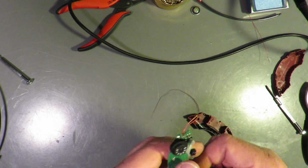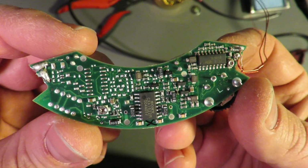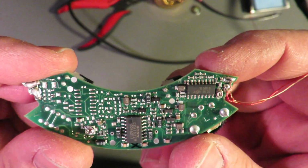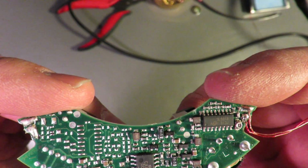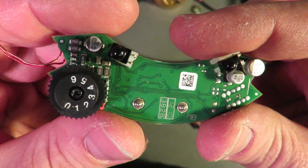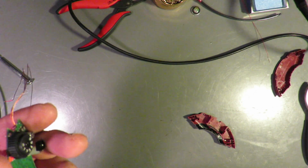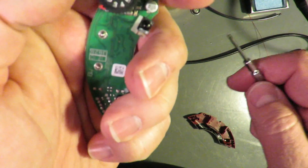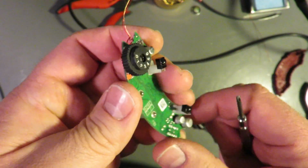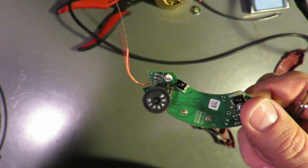why not make something? So it looks like, in case anyone is curious, the inside of these, this is the side that you will see when you open it up. The earpieces solder on to these liberally applied dabs of solder. A couple of chips in there. Don't know what they are. Apologies. There's the volume knob. It looks like, if you're having a case of loosey-goosey volume knob, incompatible screwdriver, stand by. This on here is really wiggly. Let me see if this actually helps. Yeah. So this could be another repair that you could make real quick and non-destructively, assuming that these don't rip out while you are taking this circuit board apart.